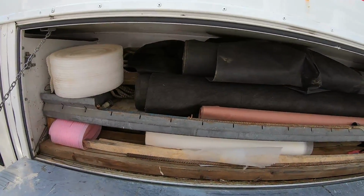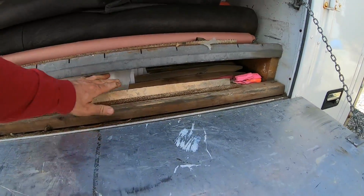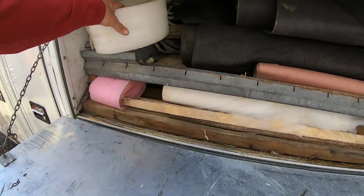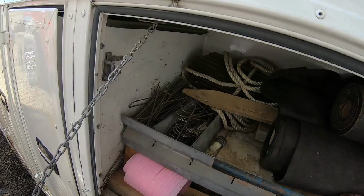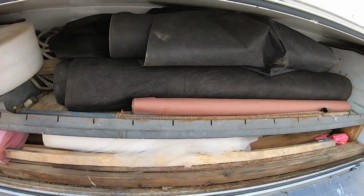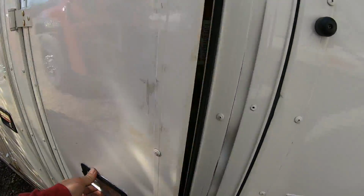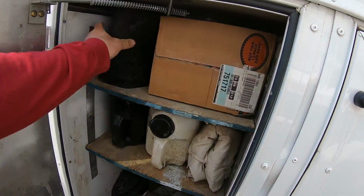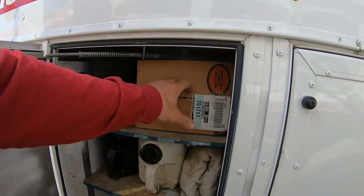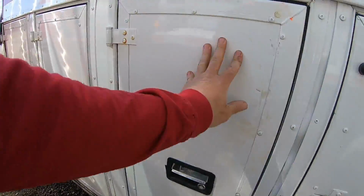This one is nothing but fabrics, filter fabrics, all my stakes for laying out a foundation. We put our prints on here when we go to do a site. Just basic, everything we need that is filter related and site prevention. We put silt fences in here, everything. Nice little compartment for that. This one, we got some oils, we got moving blankets, my, this is a case of paint, marking paint, and tarps we put down at the bottom.